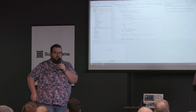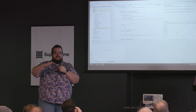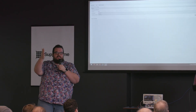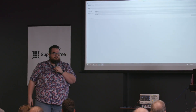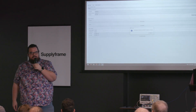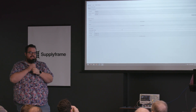Question from audience: does the reference signal need to be locked very accurately to the input signal? Answer: yes, the reference needs to be locked very accurately. In this setup we digitize both channels — the reference channel and the input channel — so we get carefully phase-synchronized input to our DSP. The trick for lock-in amplifiers is that the modulation for your measurement must be provided by the reference signal — that's the key caveat.